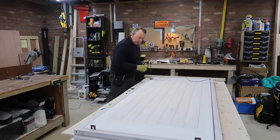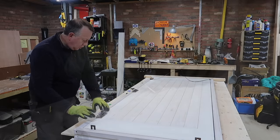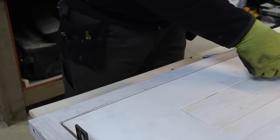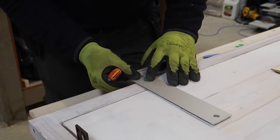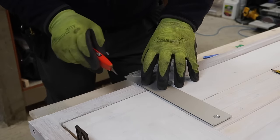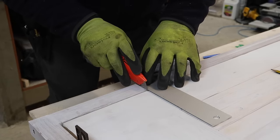The hinges I'm fitting today are to a new door and frame, so to ensure they match exactly I've laid them out and shimmed the door in position so I can accurately mark the bottom of each hinge on both. For this I'm using a Stanley knife with a new blade, as for this whole process a pencil is just not accurate enough.